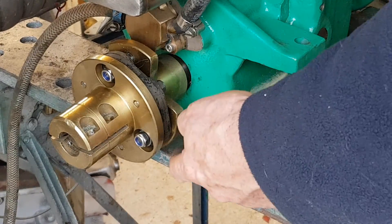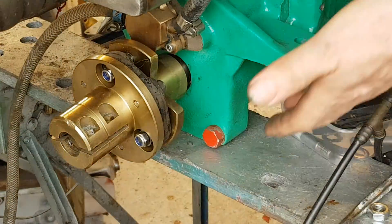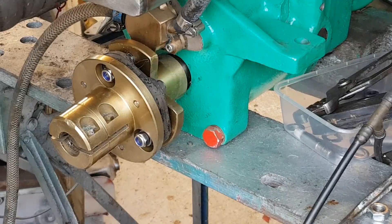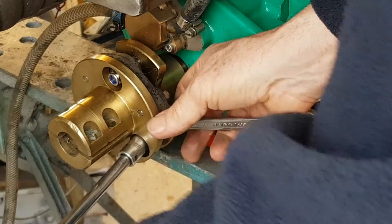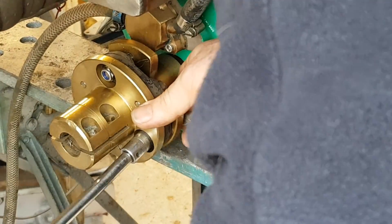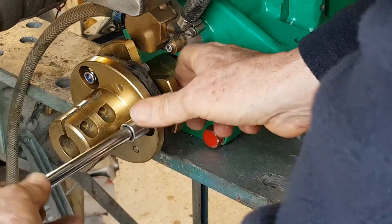I don't want a long trip to the parts place. What I always say — if you're changing the carburettor or working on the impeller — is get yourself a tea towel or rag under here before you start. It catches all the parts and tools that didn't manage to stay in place. Now we're just going to do these up, and you'll see it's a nice solution — a lot easier to assemble than stretching over the entrance, and that makes it easier for future people servicing it too.